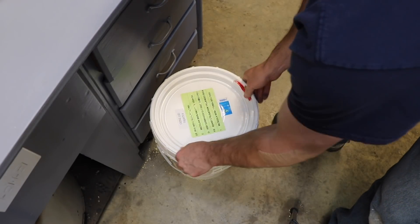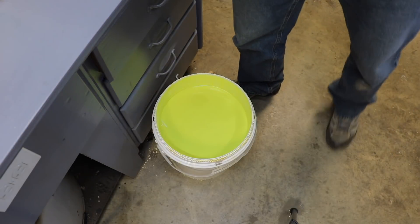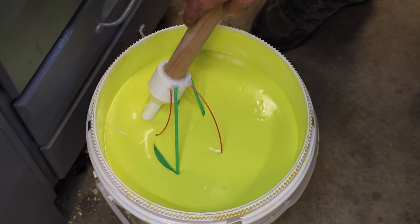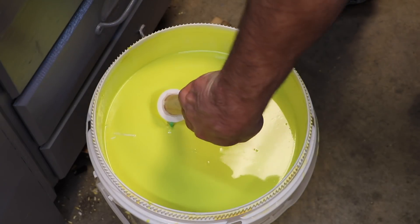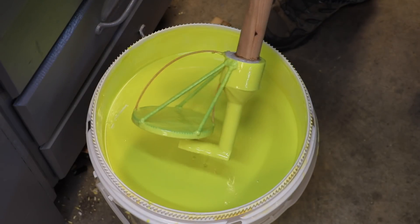This is a product called Suspend-a-Slurry, and I will leave a link in the description where I got it. It is a ceramic material that will coat my mold, and then later I will burn the mold out and fire it into actual ceramic that I will then pour the molten metal into.